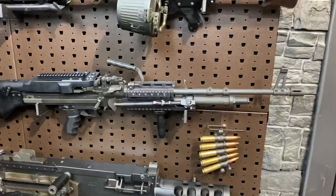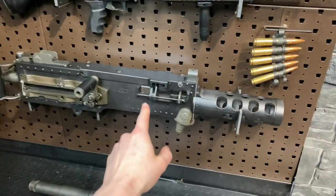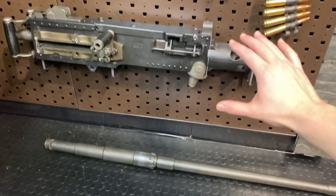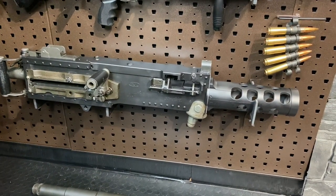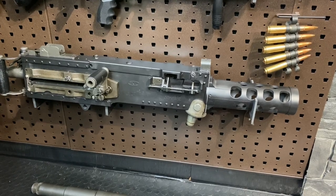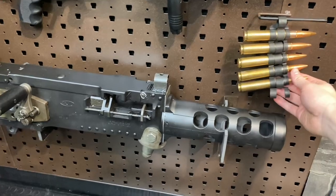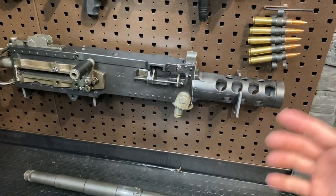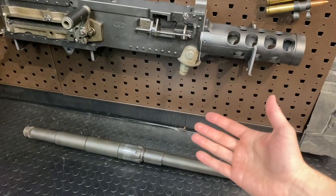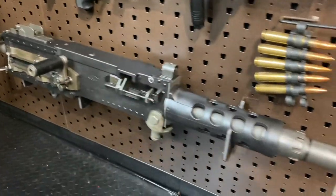All these guns basically employ various methods to quickly change the barrel. All of them require having the bolt back, and this one's got a little latch mechanism right here. As for the M2, there was a later variant designed to be truly quick change. However, due to absolutely tons of these things being manufactured for World War II by a bunch of different manufacturers, manufacturing techniques of the day weren't sophisticated enough to control tolerances across manufacturers on something as important as the headspace. You get that wrong on a .50 BMG — a high pressure round — and if it detonates out of battery or without the right headspace, you can blow up the gun. So the solution was to make the barrels fairly quick change, but they don't automatically headspace. When you thread a new barrel in, it ratchets in and you actually have to manually check the headspace before proceeding.